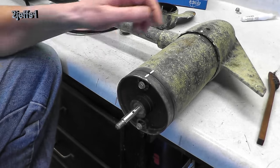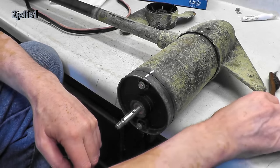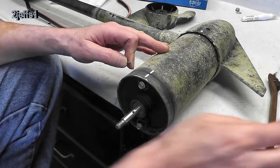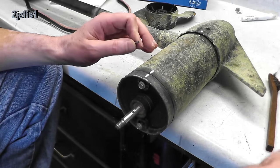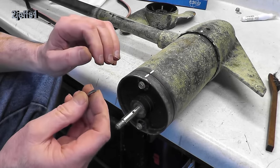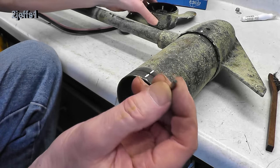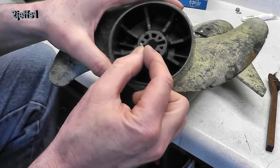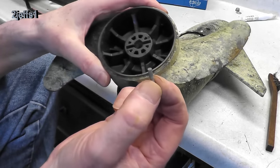Getting started on the motor, I marked the case for re-clocking orientation. Took a wire brush, cleaned the corrosion off where I believe this should separate. Cleaned the shaft with some 3M scuffy pad. And right off the bat, I've seen a problem where the pin here that drives the propeller — it's not only busted, but it's bent. That should really be the full length of this slot in here, so we'll have to make a new one of them.